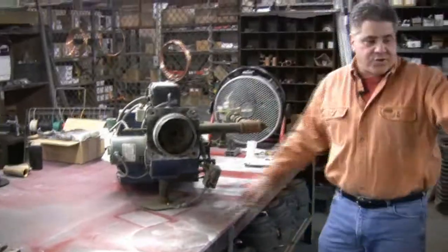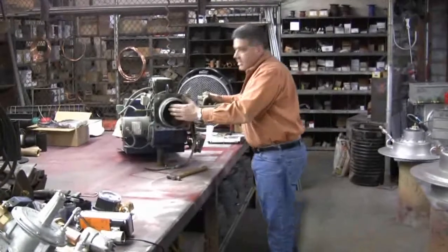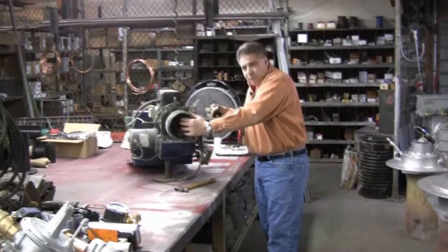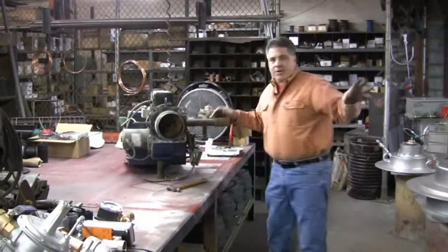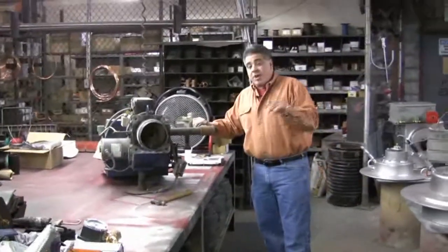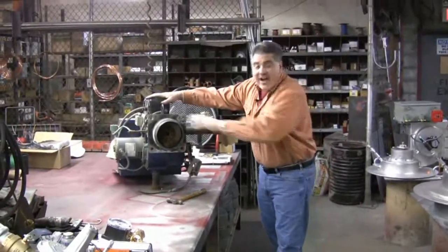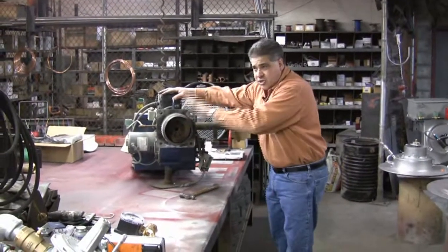Explanation about the high pressure zone and the swirl of the air turret. This is how they do it. This has been around only for about 25 years. This is called a diffuser plate. They do not get the same back pressure that the Infern-o-Therm burner achieves. The Infern-o-Therm burner can fire against 6 inches of back pressure in a combustion chamber using our patented cloverleaf. That's how we gain efficiencies. This burner fires down a much larger fire tube with no back pressure, only up to 2 inches.